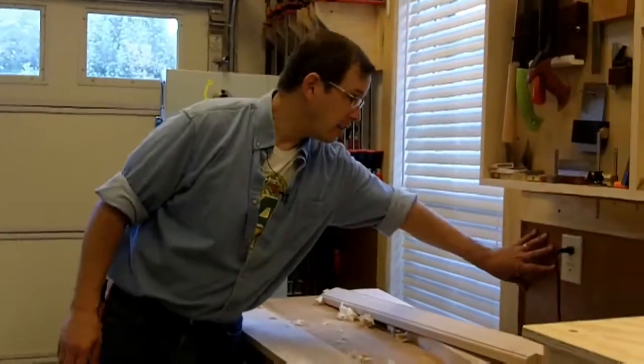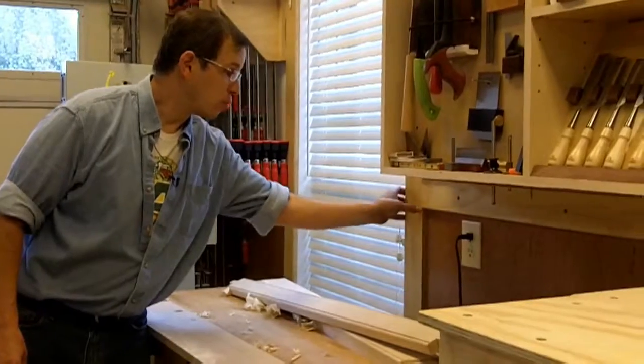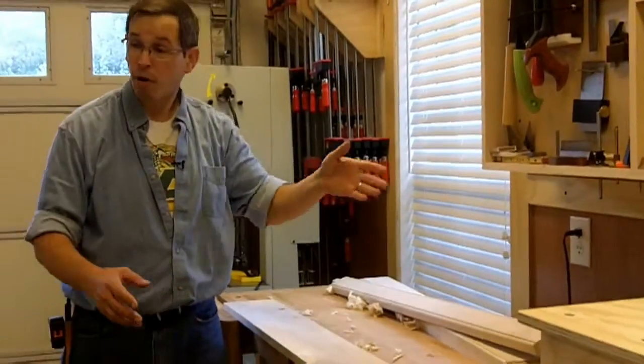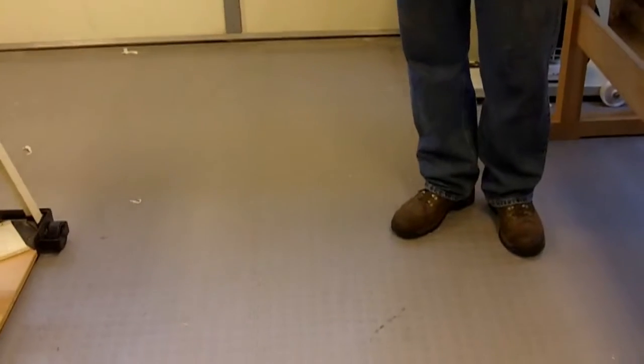In this case, I used just 1/4 inch luan to cover up the trenching. I trimmed everything out with the same 3/4 inch ply that was used to make most of the cabinets, put a little paint on the walls, and wrapped it up with a nice vinyl interlocking floor.